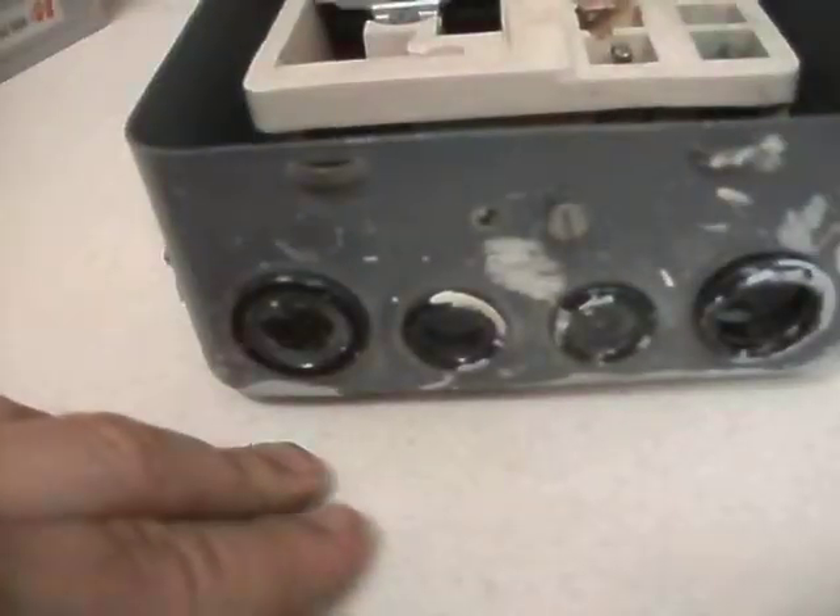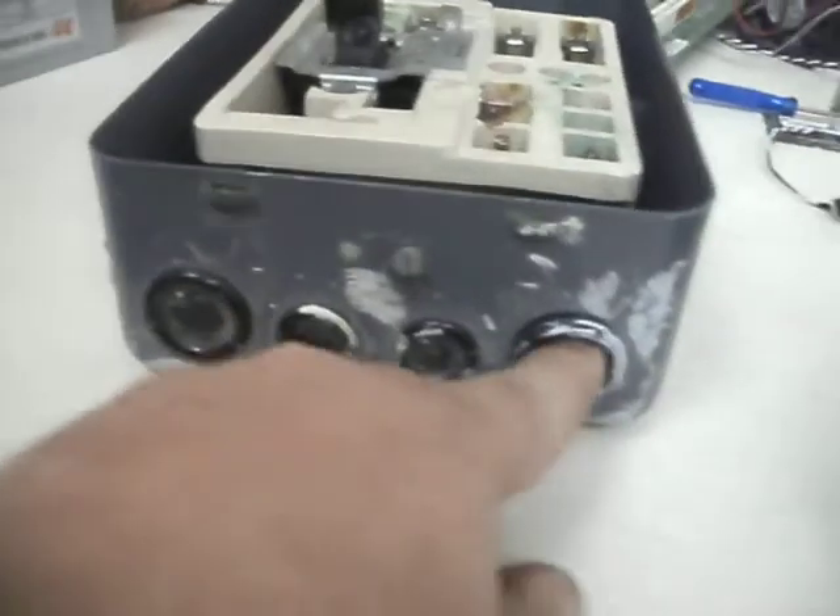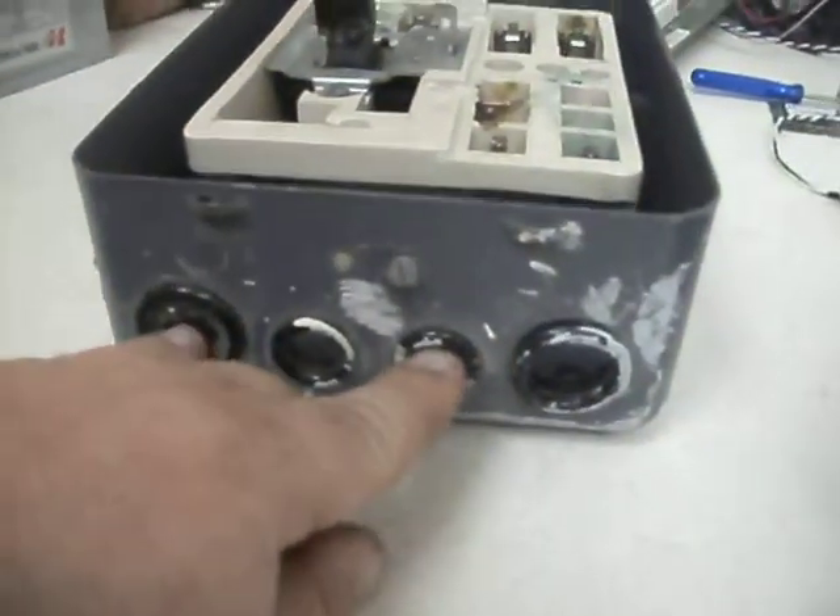As these are metal fuse boxes, you'd have to earth these out as well. There's a terminal there, and there's also one at the top. There's four exit holes at the top here — only two are in use, or have been used, I should say. These two are still sealed.